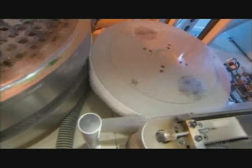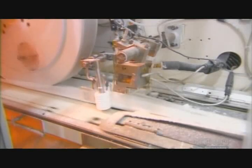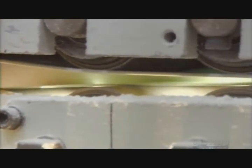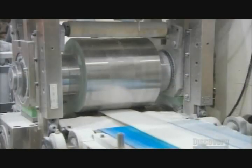This rotating drum has a vacuum that shapes the fluffy material into padding. Another vacuum drum then merges the padding to a moving web of fabric. Guides fold the fabric around the padding, and a hot adhesive seals it. At this debulking station, rollers compress the padding, making the diaper core slim enough to comfortably fit a baby. A cylindrical cutter then slices the diaper core to size.